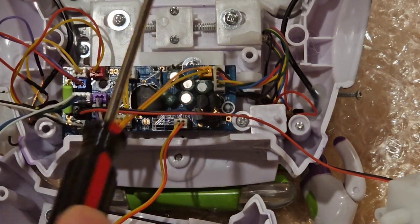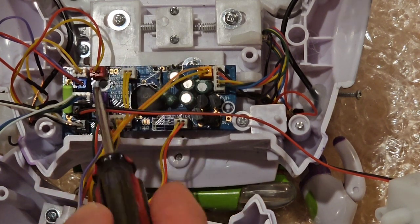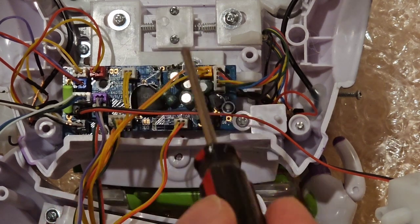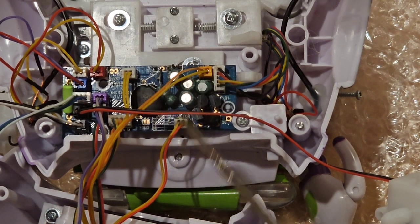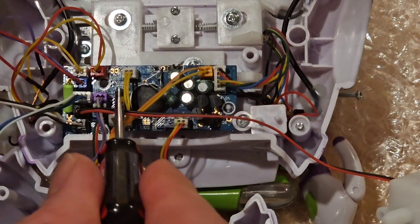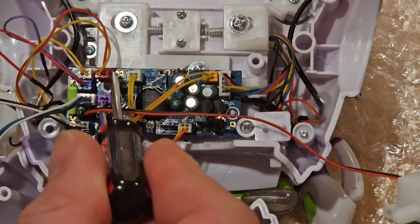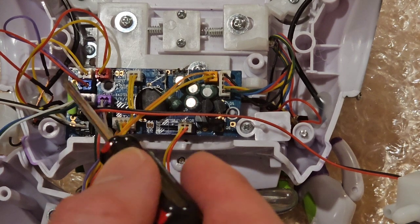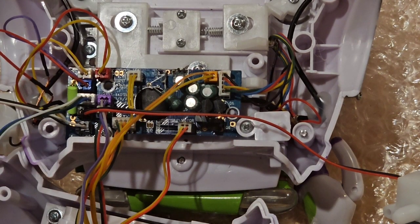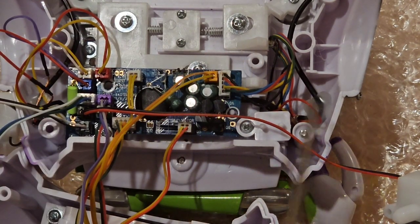Like I say in my older videos, I did show what the inside of the anti-gravity belt — the Utility Belt Buzz — and its computer board connections look like. On that one, the computer board is arranged slightly different because up here they have another plug that is four pins wide, and that does the button for his waist and the light-up functions of the utility belt. There's also a spot labeled 'chest' but it does not have any pins soldered. I think this might be a remnant of another feature they were going to implement and didn't. If I get enough interest, I could try and solder this up and see, or someone else could try it out and let me know what it does if you connect those two pins while he's on, or to see if an LED will light up there.